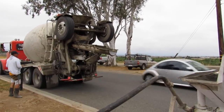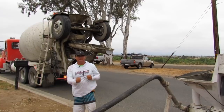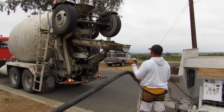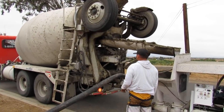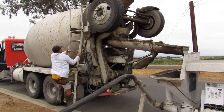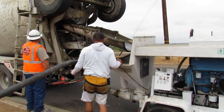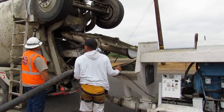You can probably pump this down to five and a half to six slump, something like that. If you're a concrete guy, I couldn't dream of doing it any other way. I don't have all these laborers and wheelbarrow guys — it's just tearing them up and eventually you need a newer group. I would suggest people start getting into pumping if you're a concrete guy, or as a service too. If I don't have any work or I'm slow, I just pump for other contractors.